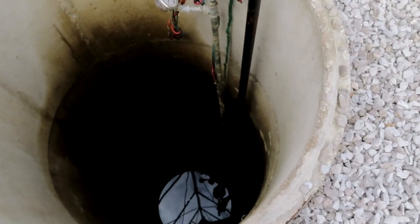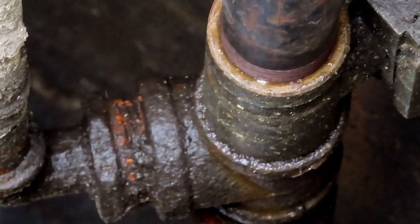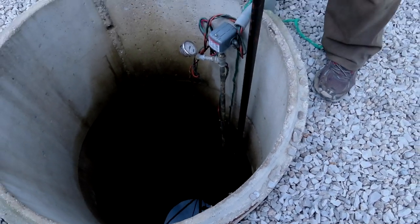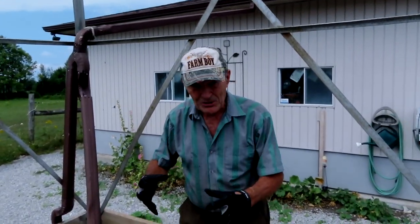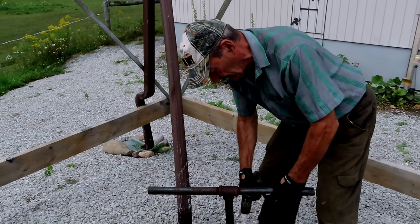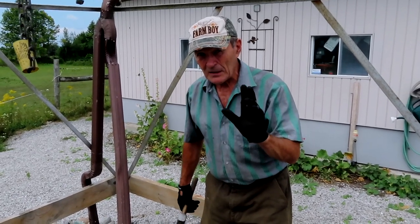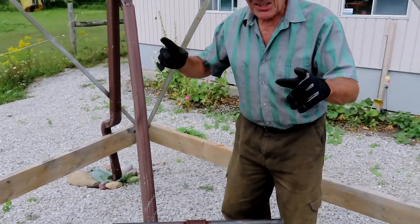You turn this in slowly — you don't want to hurt the pitless, you don't want to hurt the threads. After just a few turns, it'll grab. That's it, it's firm. If your pitless adapter has been out recently, it might pull up very easily. If it's been down there a long time, it might be jammed. If it's jammed, you can get a small sledge and tap it like so — it'll break it free, hopefully. Move it around a little bit, not too much. The pitless adapter is made of brass and it can break. So just pull it a little and tap it, and with a little help it'll lift out of there.